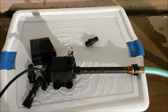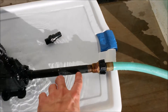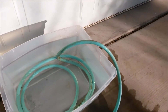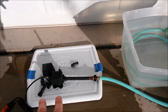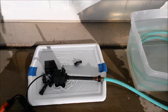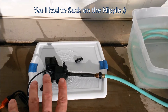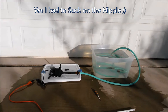Let's take it outside and see what we can do. We're going to do the inline pump test first. We have a half-inch NPT nipple, about 10 inches, to a three-quarter-inch hose adapter, to a 25-foot hose into a bucket of water. As I found out, the pump is not self-priming, so I had to suck on the output to get it to prime. Keep that in mind for inline functionality.